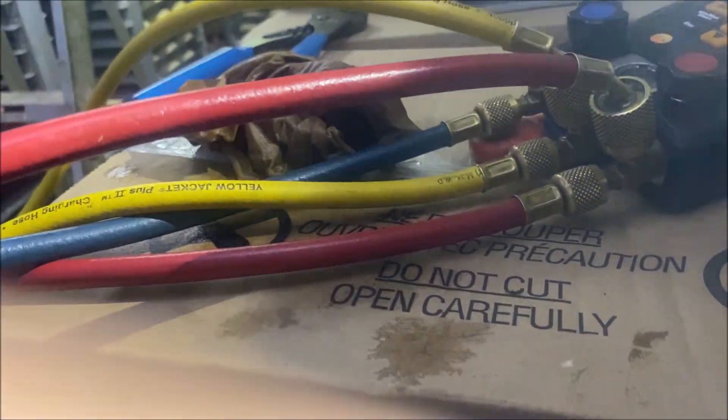Every five or six months tells me the leak is going to be pretty small, but we're going to be thorough like always and we're going to find this leak. First things first, someone has put some dye in there, which I hate for my gauges, but it is what it is. I've equalized the system — we have 126 psi of pressure on the low side, that's plenty to do a leak test. We cannot gas and go — that's a big no-no here in our area.